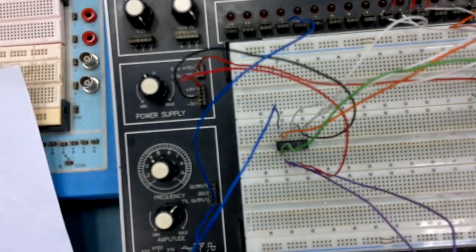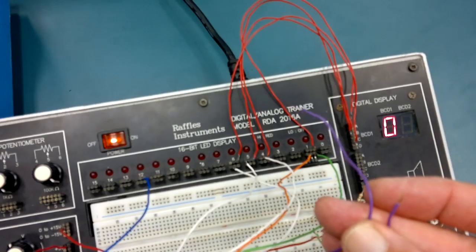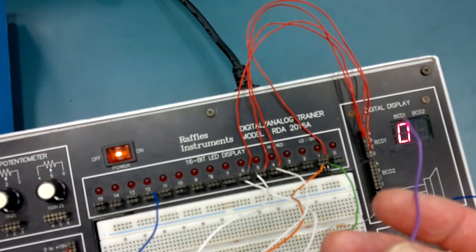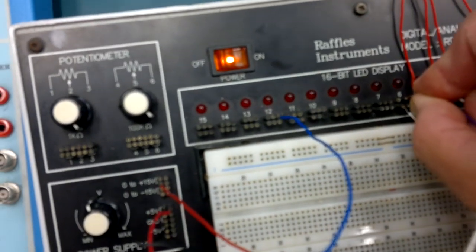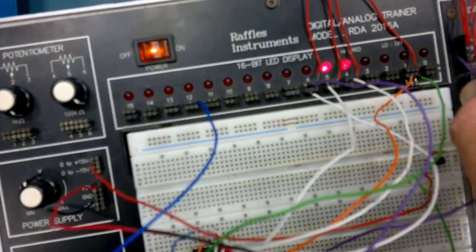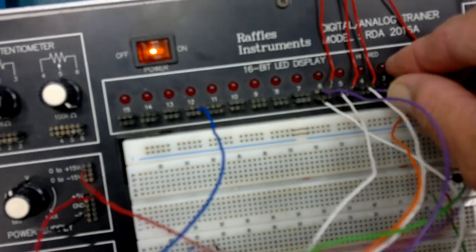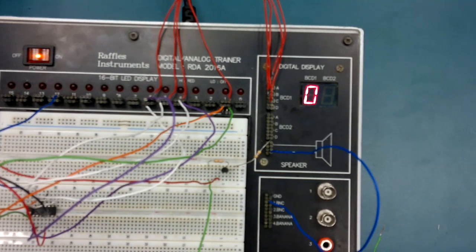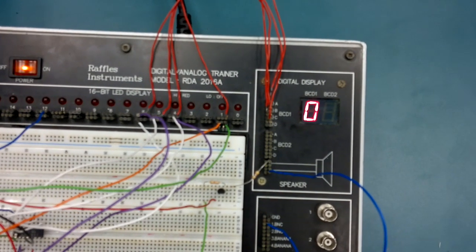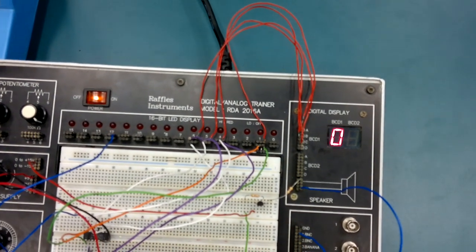And then notice now it's still stuck, because even when you don't connect something to TTL, it looks like a logic one, logic one. Now, let's go to the 8's line. And then let's go to the 2's line, which means now every time we have 8 and 2 together, it's going to reset. Hey, look at this. Goes to 9, straight back to 0. So we have now made a mod 10 counter. Easy as that.